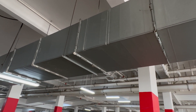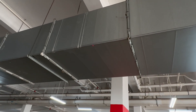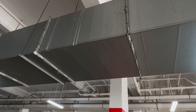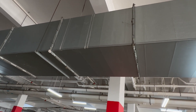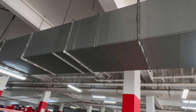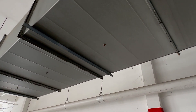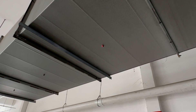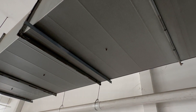The interval between joints is about 4 feet. You can see this line on the duct — we call it beading — and it reinforces the duct to make it stronger so it won't deflect. When the duct gets bigger and wider, there's a bolt here which is actually an intermediate tie rod. There's a rod securing the top and bottom of the duct; because the duct is very wide, you need a tie rod to secure it, otherwise the sides will bow out.